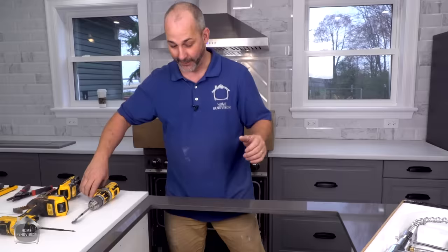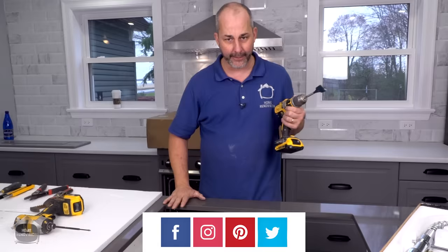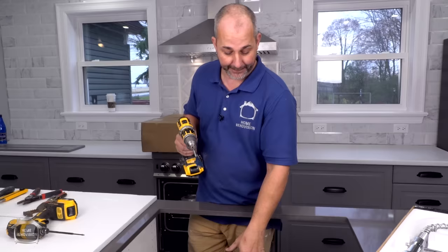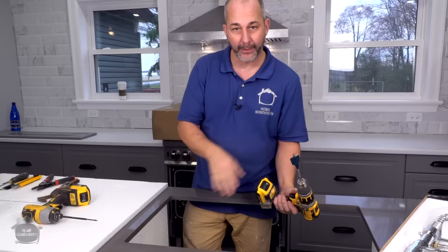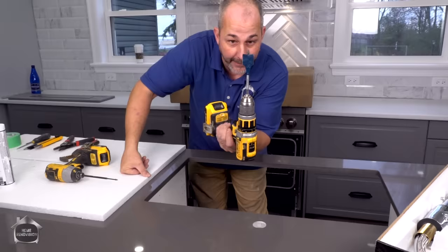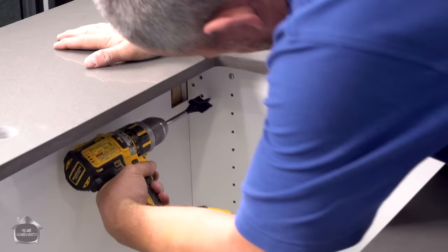Let's get into this right away. First of all, before we get started, we have to think through our process because we have a sink, a faucet, and a dishwasher. There are a lot of cramped spaces involved. If you have an opportunity after your counter goes in to take care of drilling all your holes and sorting out all your mechanical issues, that is the time to do it before you put your sink in. In the bottom of this cabinet I've got my holes drilled for my water supply and for my drain, but I don't have the holes drilled for the dishwasher yet. We want to put in a hole for the water supply going to the dishwasher and a hole for the pipe that comes to the dishwasher for the discharge. Generally you want that pipe coming up near the top of the cabinet and then coming down to the drain. We're going to take an inch-and-a-quarter bit and drill a hole near the top of the cabinet at the back and one near the bottom at the back, so that when it's time to install my dishwasher I'm not going to be fussing around on my back upside down drilling holes.